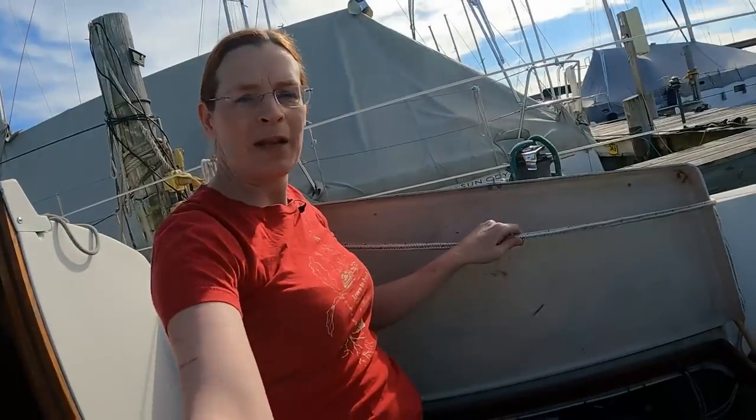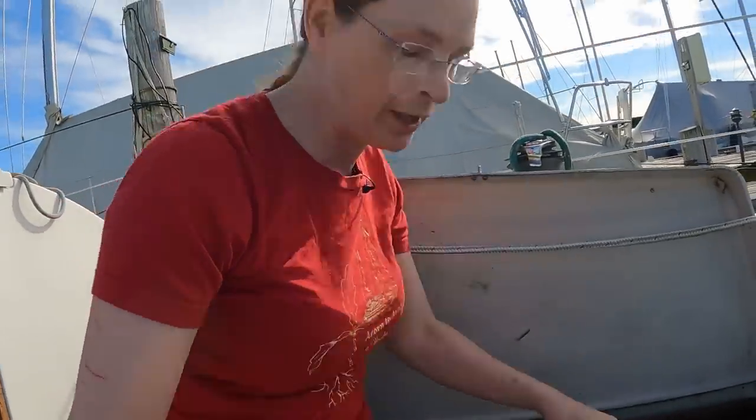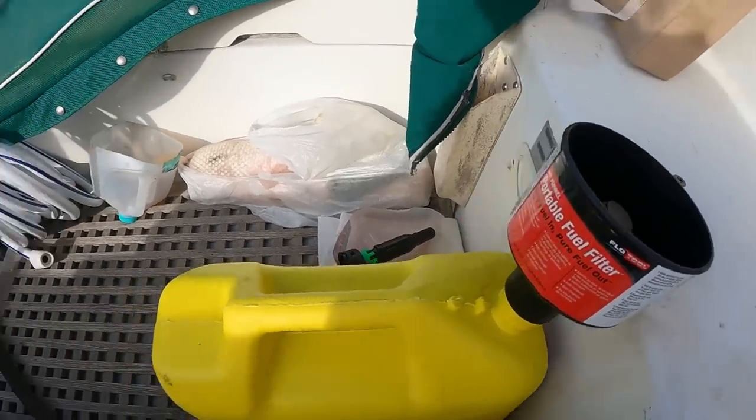So the yard mechanic had hoped that he would have access to a polisher that would help me clean the tank without actually removing the tank from the boat. Unfortunately, he doesn't have that, so I'm back to pulling the rest of it out. Before I do that though, one of the other things he told me about was tying off the lazarette hatch. He once was working in a boat in the evening by himself in October, and the wind closed the lazarette hatch, and it was one of the kinds that latches when it closes. He told me how he got out, and let's just say it didn't sound like fun. So, pro tip from an actual pro: tie off your lazarette hatches when you're working inside the boat. So let's get back to it.